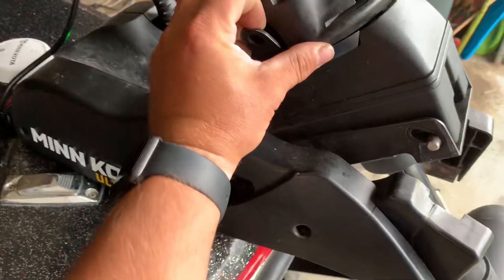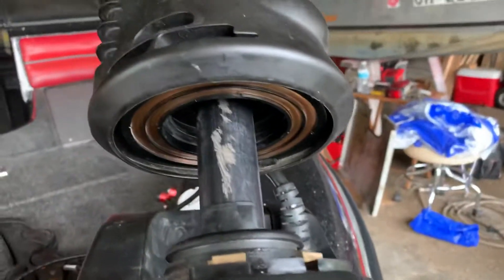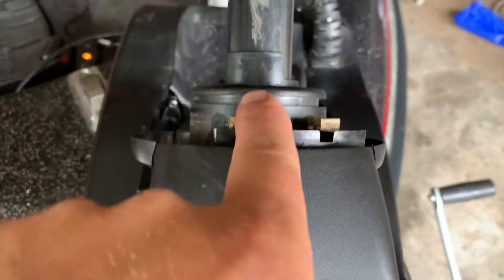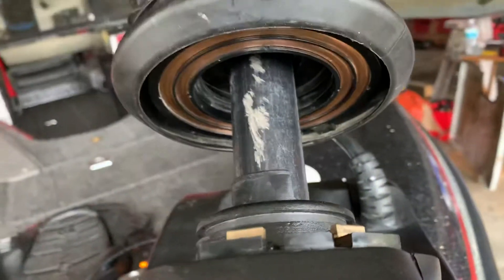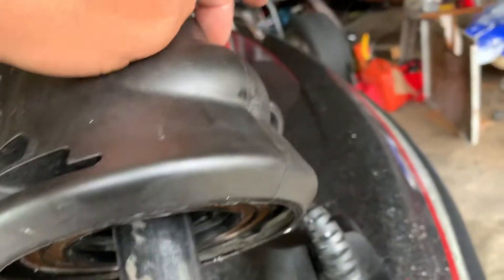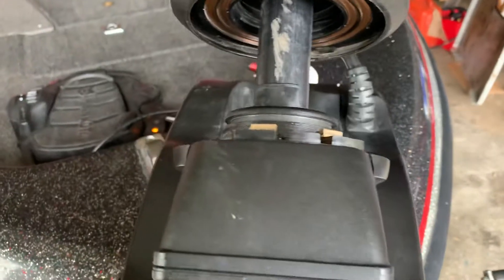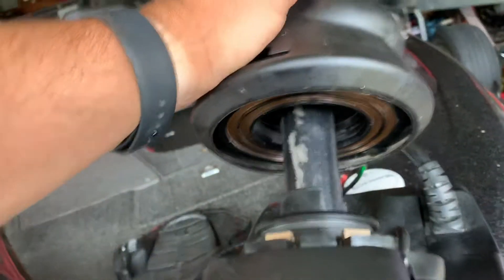If you've ever had to manually stow these, you pull this tab out and then push it up — it's kind of hard to do with one hand. On the bottom of the power trim unit, we have this plate which has contacts for your brushes. There are four brushes. I'm not entirely sure which are positive and negative — it sends some type of signal and power to the unit, and there's a little computer inside too. The inside brush connects to the inside of the disc, and I believe that's positive going straight to the motor. I ohm tested the motor with my meter and it tested fine — virtually no resistance at all, so the motor wasn't damaged. Then I ohm tested the outside, which is a black wire to the motor, and I got really funky readings — it was jumping all over the place, not holding steady at any particular resistance.